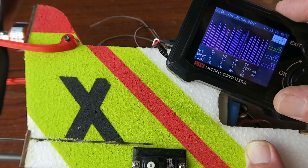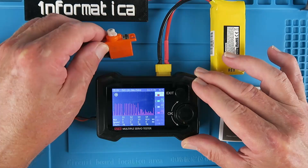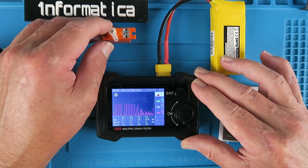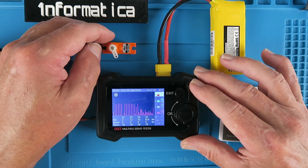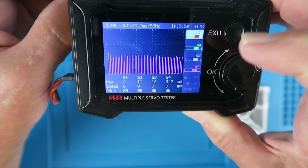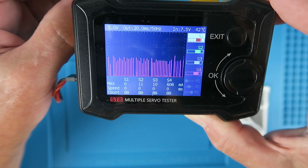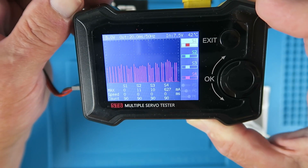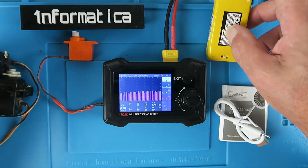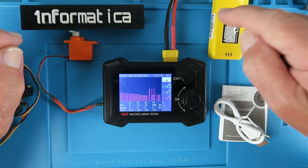All very useful information. Let's now go and take a look at some of the other features in brief. I've chosen this little orange servo, which is a MAX MX50, and that's the same size. Let's check it for its current draw. We can see there on S4 about the same as the other servos I tested - around the 600 milliamps. And listen - no strange crunchy noises. I'm powering the unit now from a 2S cell. As I mentioned, the port here is from 7 to 28 volts, so you could go up to a 6S cell, which makes it very convenient.